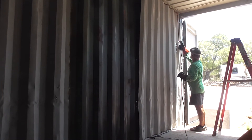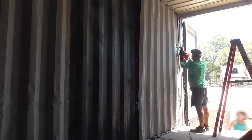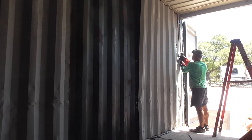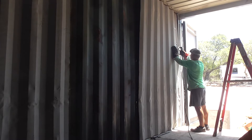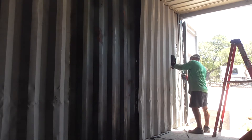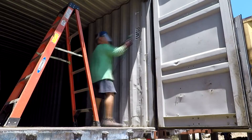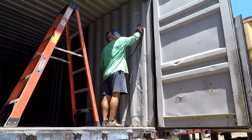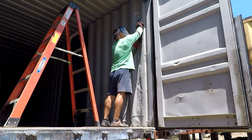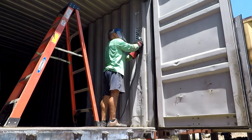I'm not gonna show you every single cut I make, but these are the first few ones. Plasma cutter tips — I didn't realize I had probably three or four different sizes. The first one I used was the one that came with the plasma cutter and I burned it up after three or four containers. The last one I put on, which you'll see near the end of the video, is the tip probably made for cutting this kind of stuff. It's got more of a castle and a little more air gap to blow the material away from the cut. Both worked really good, but they don't last forever — they're disposable.